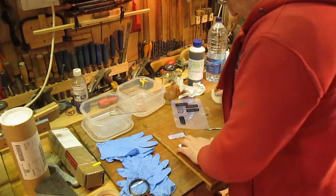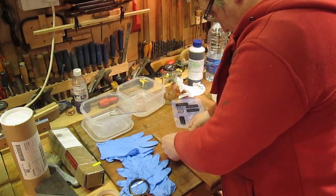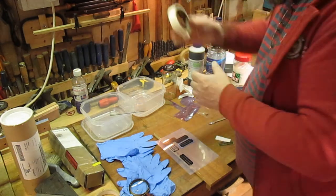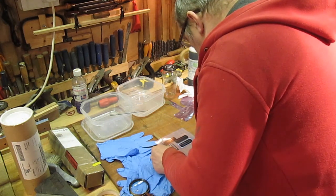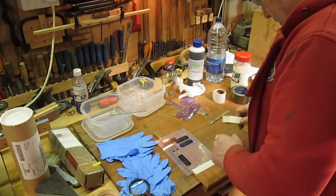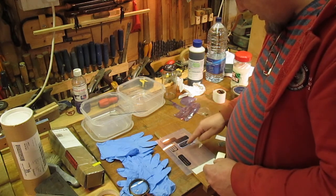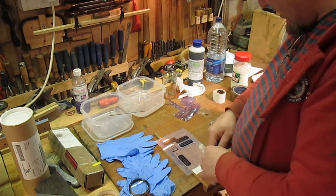If you're on a super board, a bit of double sided tape — put it on there and just stick that onto it. And stick that over the top. I think I'll use masking tape on this one. Right, all that lined up. The idea of this is — you can see there I've done a negative one. Where sunlight can get to the lettering and the border, that will actually harden the photo-sensitive film. Those are the bits that will be saved from etching; everything else will be etched.